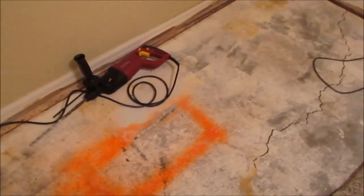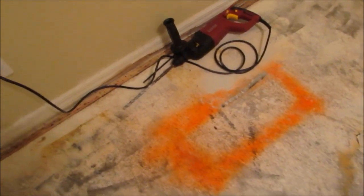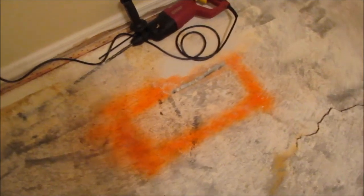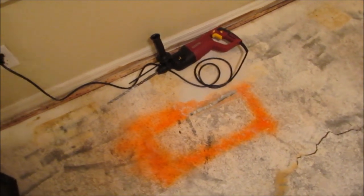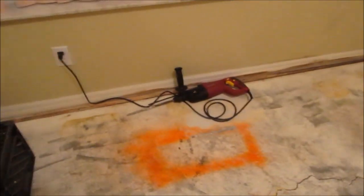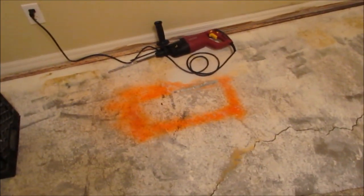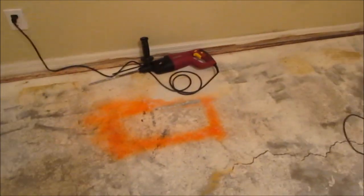How I found this particular spot is with a digital infrared temperature meter. I read the temperature because it is a hot water leak. The way I originally came about this is that a person from the local water company stopped by the house last week and said hey, you've got a leak. He showed me my water usage from the last five months — all of a sudden I had almost twice the consumption, so he knew there was a leak.